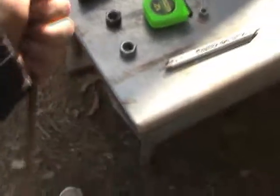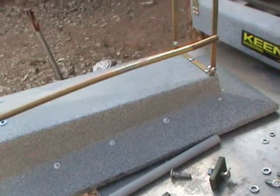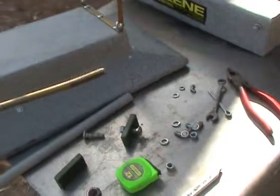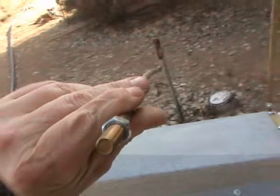The first step in this modification is to straighten the rod. So the way to do that is put the nuts on both ends and bring them all the way down to the end. That way when you're straightening the rod, or I'm straightening the rod, if I ding the threads, I can chase those dings out. If the nuts are on, I just back off the nuts, and hopefully the ding will get removed. So first step, straighten the rod, otherwise measurements are not going to be accurate.